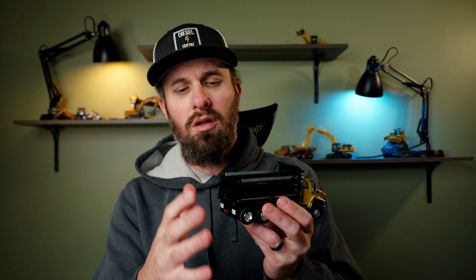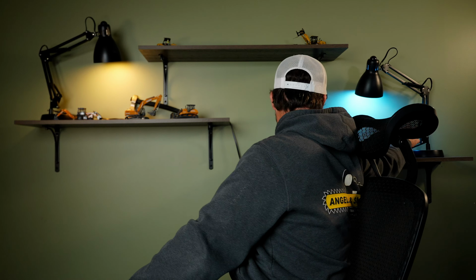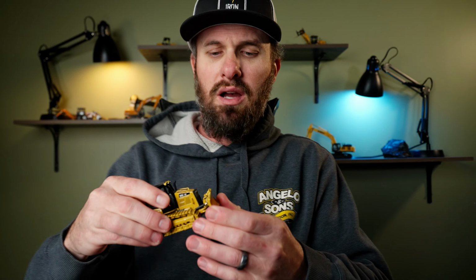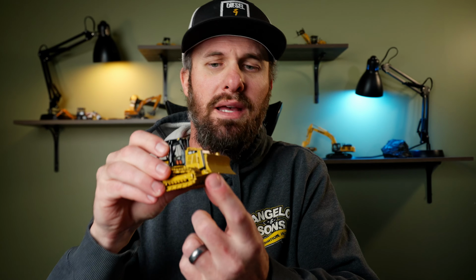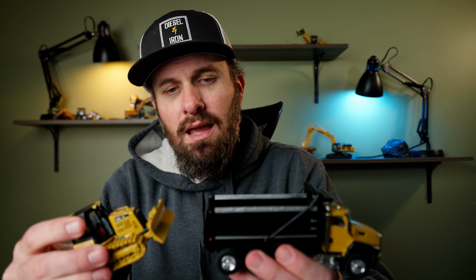It's all about applying force evenly. You don't ever want to use corners. Let me just kind of summarize there. You don't ever want to use corners. So let's say we've got our little D5 here, and I'm going to come up behind this truck. I'm never going to angle my blade off to where I'm going to encounter just this edge unless I have a pintle hitch or something that I know I'm safe to apply a lot of pressure to a very specific point. Otherwise, what I'm going to do is I'm going to come up behind this truck